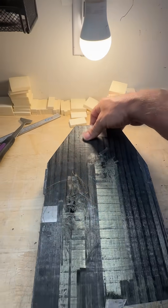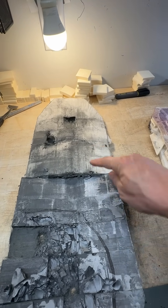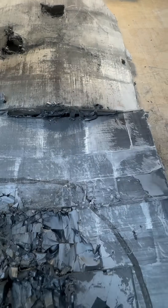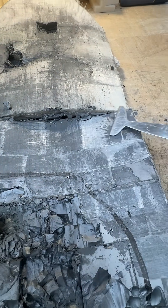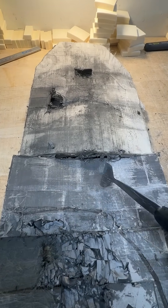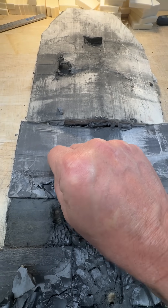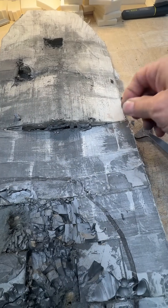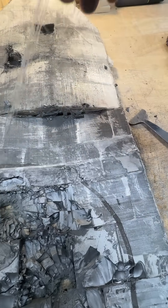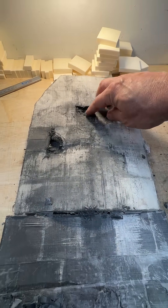I've already pulled this apart and what I'm going to show you is the backer and the reverse side of the strike face. On the reverse side of the strike face you can see some material here. Folks claim this is a laminating layer put on by the manufacturer, but really it's showing you that the adhesive between the tile and the polyethylene is quite good — this is just the top layer of the backer. I know this for a fact because I built this plate.